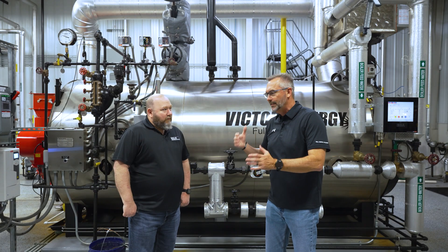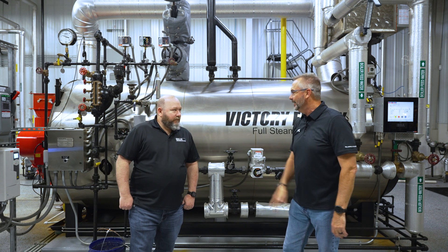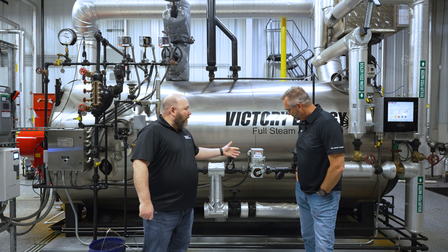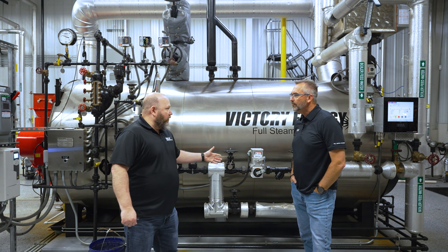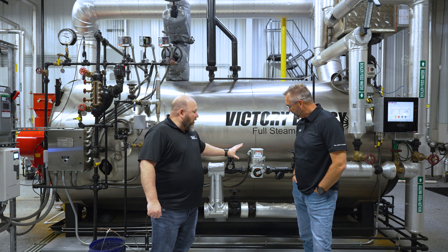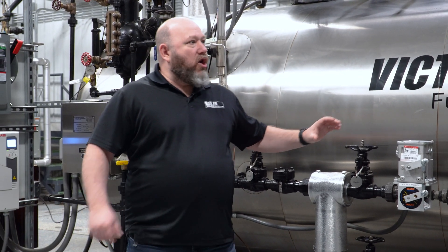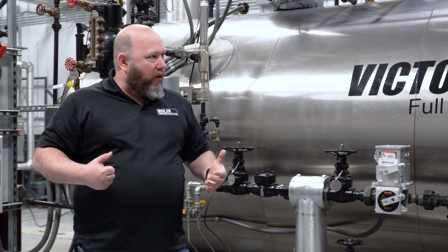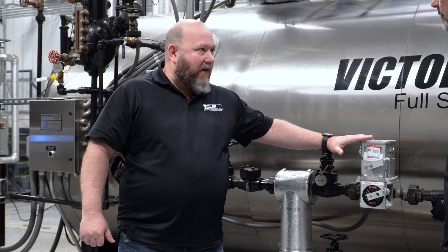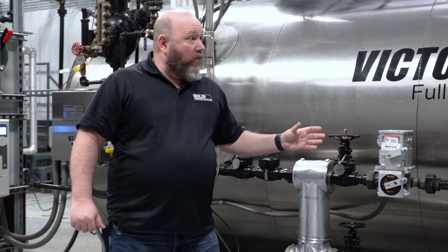Brian came to us and said, let's talk about sizing. We've done a lot of stuff but we haven't done sizing, so I'd love to hear more about it. The valve obviously has an application that we built it to suit. The application for this valve is really boiler modulating feed that is not like a huge batch load process where you're really drawing hard on the boiler. These actuators have actuating times really suiting this valve to the application for what it's intended.